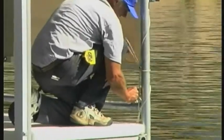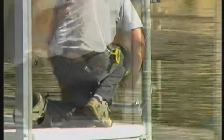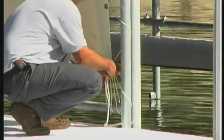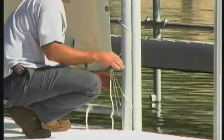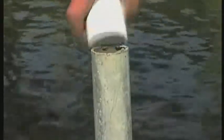We recommend tying a small knot in the center of the rope and start stringing it from the middle two loops at a time. String it out towards each end, then tighten from the center out. Go under the 88-inch pipe, through the grommet, under the 88-inch pipe, through the grommet, and repeat halfway. Then go back to the middle and go the other way. Tie off at the ends. The safety caps need to be twisted onto the pipe because they are designed for a snug fit.